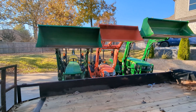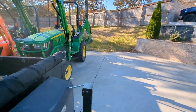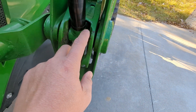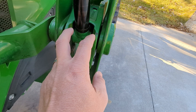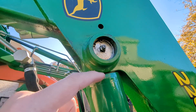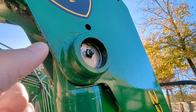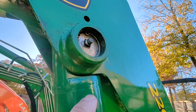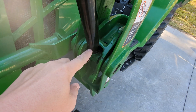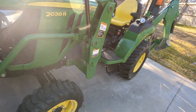From the John Deere point of view — if you're looking at your tractor thinking yours doesn't look exactly like that — you can see we could capture a little bit more here, but this really interferes so we chose not to take it from there. We have to have this clearance here. With the stock cylinder, it could actually go into this gap, but these are wider than that gap so they have to stay out. In order to stay out, we had to bring it out further, and to keep the retracted link the same we had to capture a little bit more here.